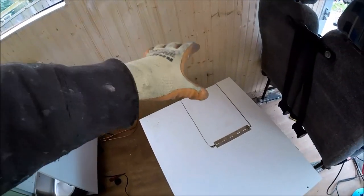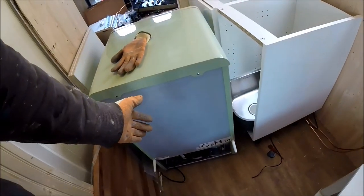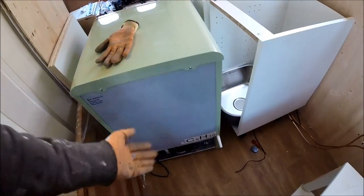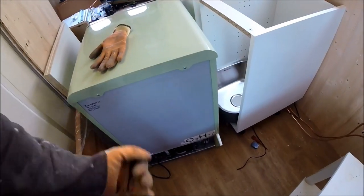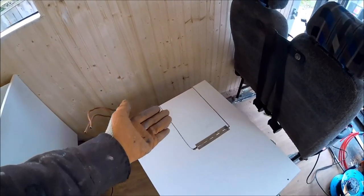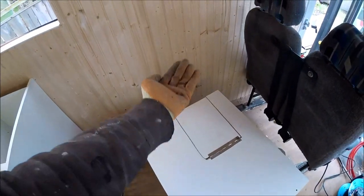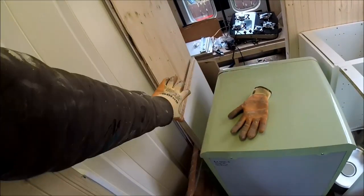And I'll also probably put a hole in the floor for where the fridge is going to be going, because the compressor fridges do still need air ventilation coming through across the back of the system. It helps with the cooling of the system itself. So again, if there's a dropout hole in the floor, it will just naturally draw colder air up, and then it'll vent out the side where I'm going to put a little vent in the side of the Conti board as well.